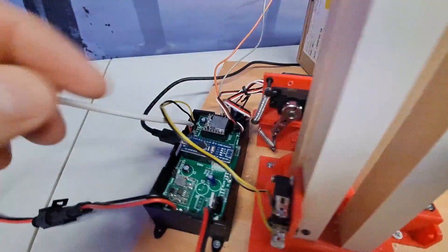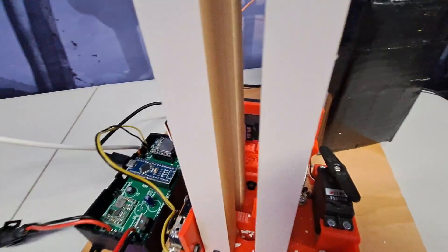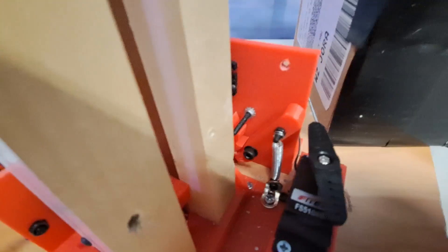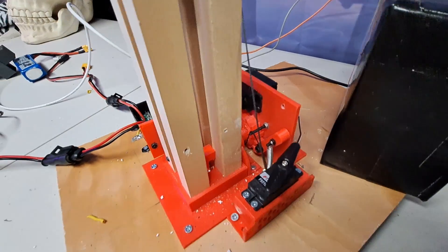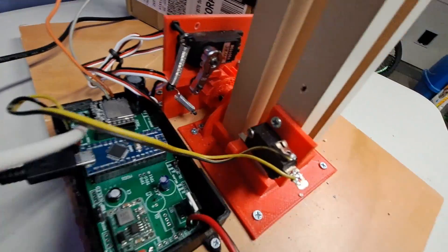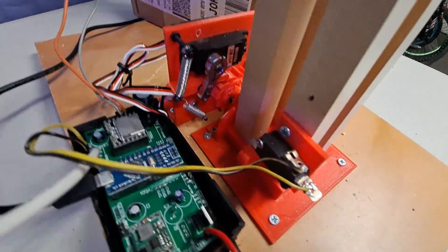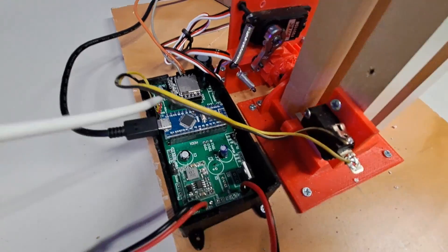Around the other side, a plastic piece moves up and down — this is called a pawl (P-A-W-L), and this is called the ratchet. The servo keeps moving its arm in and out; the pawl, using a return spring, flops up and down. As it does, the string gets wound around the pulley connected to the ratchet, pulling the prop down step by step. A micro switch is set up as a limit switch, which tells the processor it's reached the bottom of its travel. Once there, it just latches — you don't have to keep it energized.